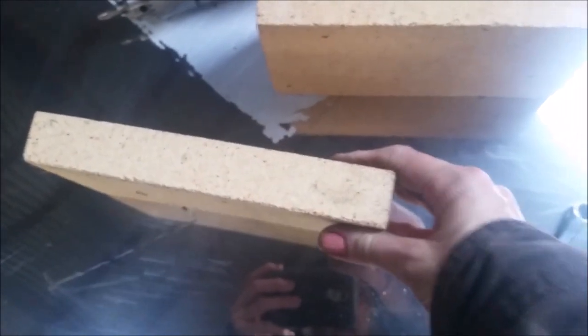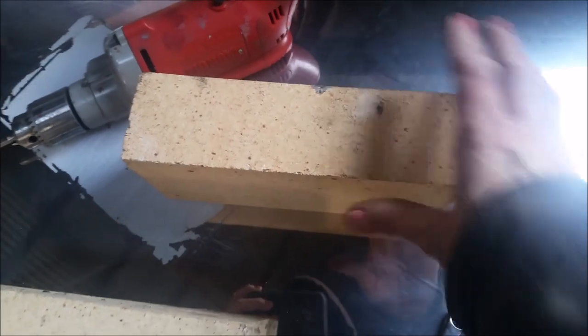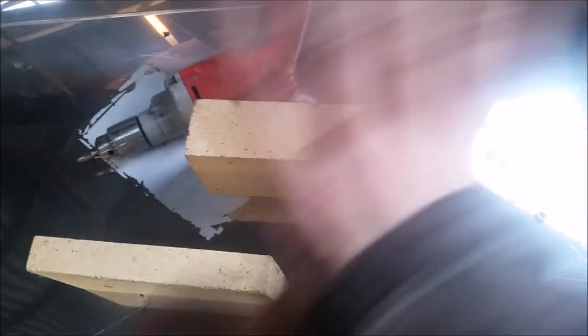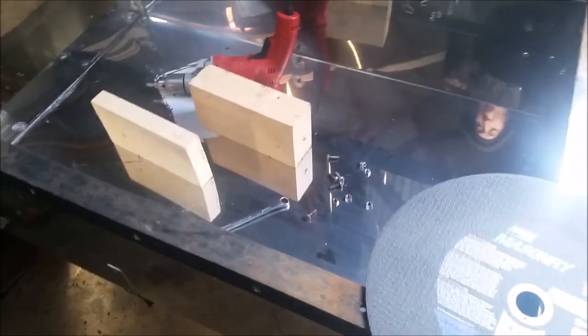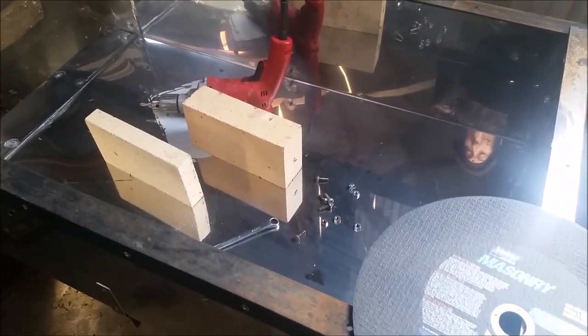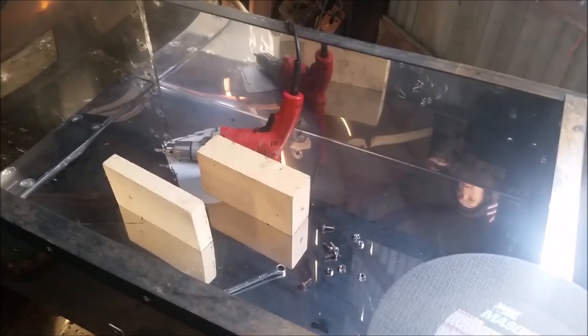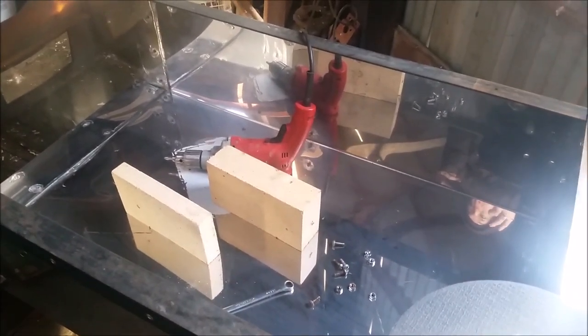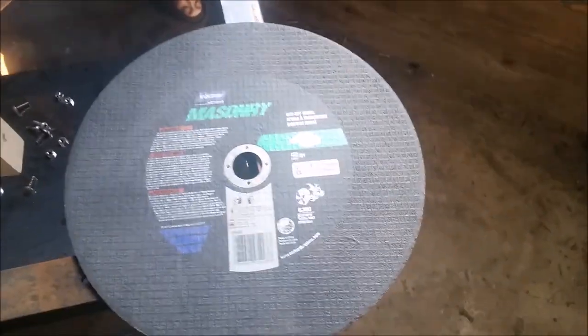This cement fireproof brick is going over the insulation — this is a half or split block and this is a whole block. If you look at my bricking video you'll get a better understanding. It's a layer of insulation, then layers of bricks all over. I'm going to be painting it, and the holdup has been cutting these blocks. You have to wet-cut them or cut them outside because the amount of dust is extreme. You want something heavy-duty for your safety mask.